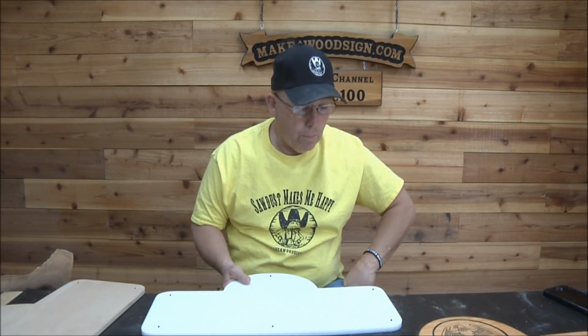That's always the best way to go. Time after time I see people, especially with the Live to Ride, because it's got so much shape to it, if you happen to nick it or come up over the edge, and you ruin your original pattern, you either have to repair that with something, Bondo or something, or you have to get another one or make another one. If you keep your master up on a shelf, hopefully you'll never need it, but it's there in case something happens to this. So that basically is what I really wanted to go over.